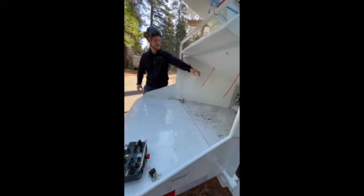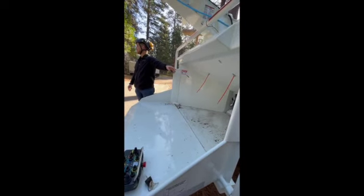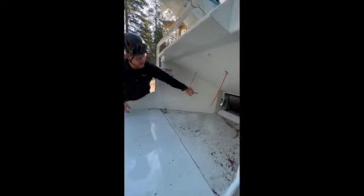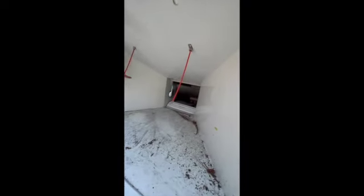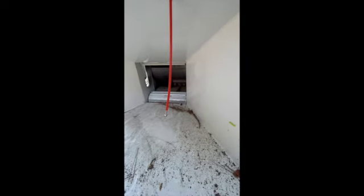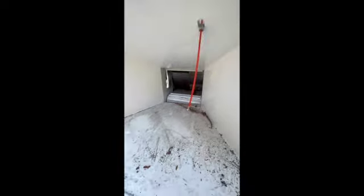Your anvil, guys, is going to work the same way as your engine adjustment works to adjust your belts. So you've got 5 bolts there. You can see the bottom of the threads just at the top of the anvil. They're not actually coming out, they're sitting flush with it. If you guys would like, we could crawl underneath the machine and go over it. Essentially, your 2 outside bolts have those adjuster bolts on them, 15/16.